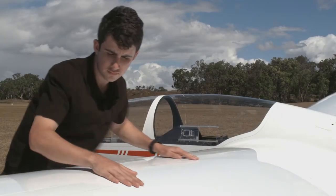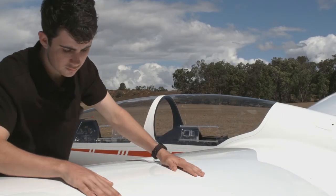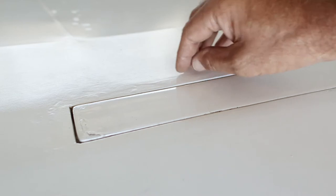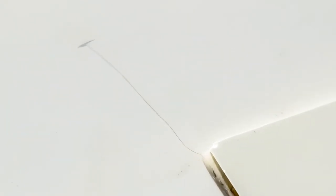As you come to the air brakes, check around the box for signs of cracking or failure. On fabric covered aircraft, pay extra attention to the join at the trailing edge of the box, which may lift. On composite gliders, almost always there will be small diagonal cracks out of the corners of the box. These are generally okay, and many inspectors will have little pencil marks to indicate where they were on the annual inspection, so that any large changes can be quickly noticed.